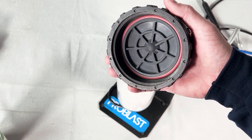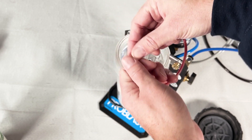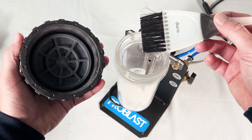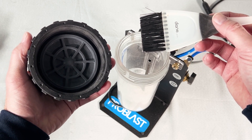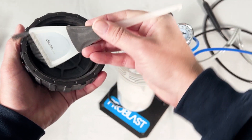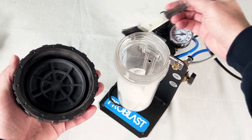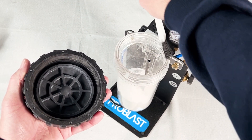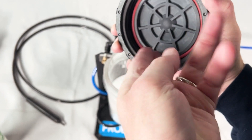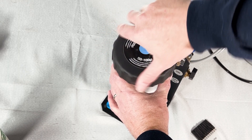While the lid is off, make sure there's no dust on the O-ring. Also, it's a good idea to brush out the grooves on the tank and lid to ensure there's no media or dust on them, because worn out threads can cause damage over time, including leaks, and you need a completely sealed system to function properly. It may also lead to the lid getting locked on, and you don't want that. You also want to make sure that the O-ring is secure when you put it back in. A loose O-ring can be very problematic. Make sure to screw on the lid nice and tight, but not too tight.